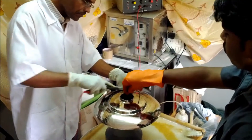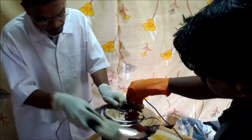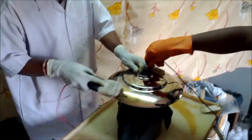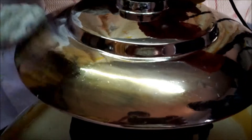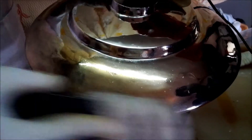Plating is carried out with a platinized titanium graphite handheld anode. This brushed anode is wrapped with a thick layer of cotton and soaked in either non-cyanide silver plating chemicals or gold plating chemicals. For uniform color and plating thickness, proper current as well as consistent brush strokes are required. Then washed with wet deionized water cloth, then cleaned with dry leather cloth to remove any water stains left from the surface.